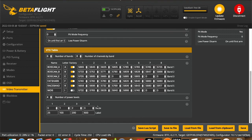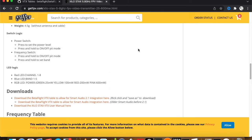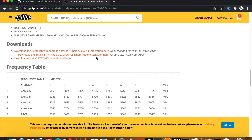So what I've decided to do is go to GetFPV, and we get down here. Obviously, this is the Xilo video transmitter, and see down here they've got a VTX table for smart audio for this particular VTX, and it says smart audio 2.1 integration. I've already downloaded this, and I'll put a link in the description of the video, so you can just go ahead and download this for yourself. What I'm going to do is copy the VTX information and load it into Betaflight, and hopefully that takes care of the VTX always being in pit mode. It's like a forever pit mode. So we'll go ahead and do that.